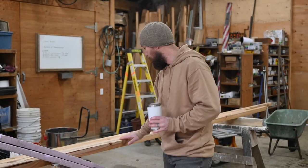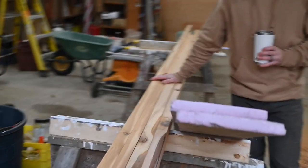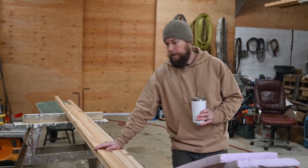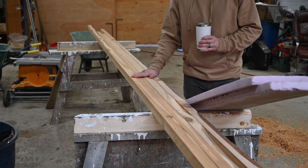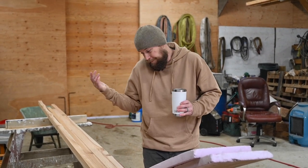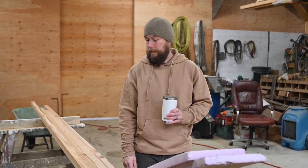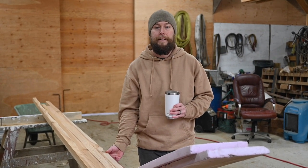And I've also milled up a bunch of crappy old cedar that we're going to use as backing. So that'll be the 2-inch depth. And we'll use that as backing wherever I've had to remove the backing. And cedar's not the best to use for holding power for the screws going in, but it's what we have. And it's free.